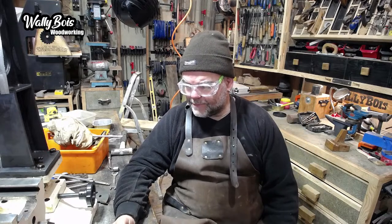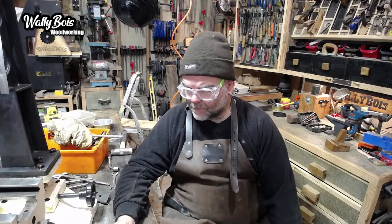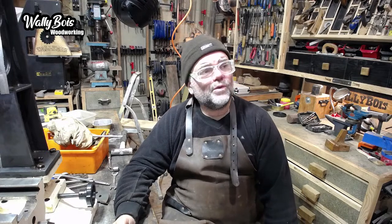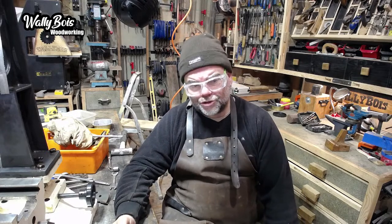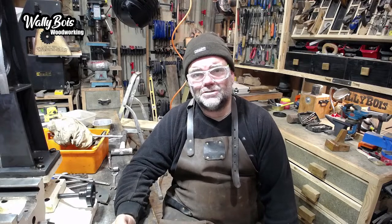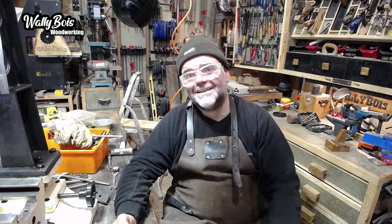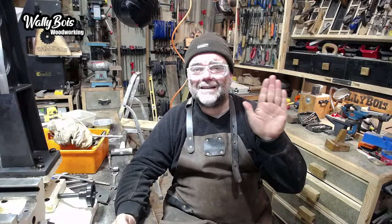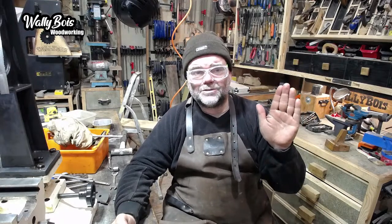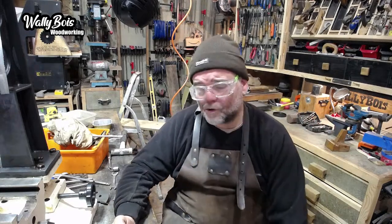Won't the paint reduce the absorption? Yeah, you don't paint anything if you can help it, because that will reduce the absorption. Bernard's right. What it will do, even if they're painted, is break up the direction. That's the main reason they have little peaks. Instead of the sound bouncing off a flat surface at 90 degrees, or the same angle it hits at, it'll disperse it into all different angles. So effectively, it makes it less of a problem.